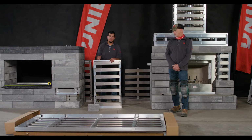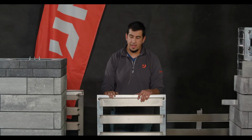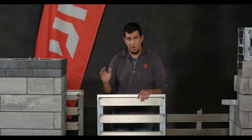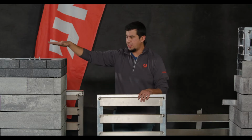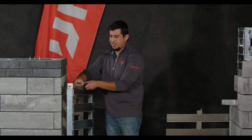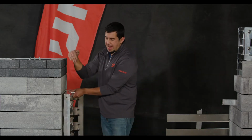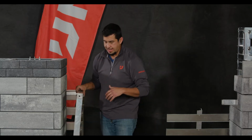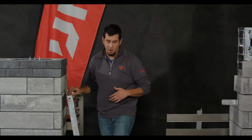The unit here, as I see it, is 41.5 inches wide by 83 inches long, with panels that'll give you 87 inches in length. So 87 by 41.5. If you want to go a little bit smaller on that footprint, you swap out that oversized end clad for a standard end clad, and now that gives me a 32.5 inch wide unit. Again, a little bit smaller footprint, to fit whatever the job site may call for.